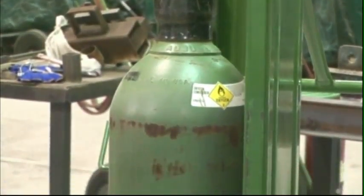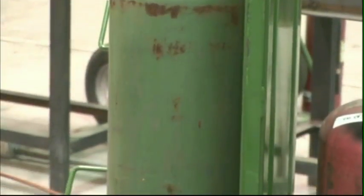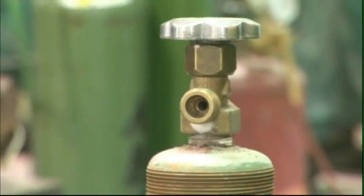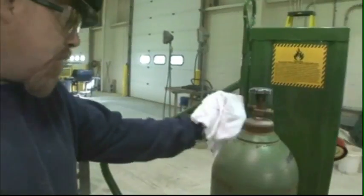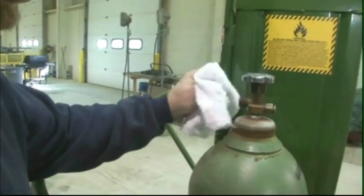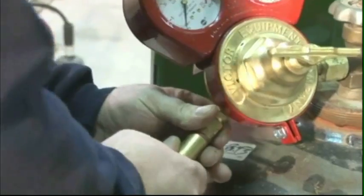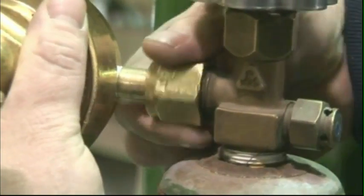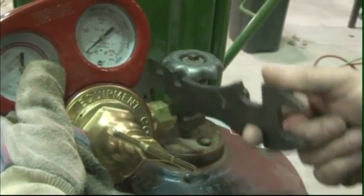Before you fire up your cutting torch, you need to conduct a thorough inspection of the oxyacetylene equipment. Inspect the cylinder valve and regulator threads for traces of oil or grease, and for any damage. Connect the acetylene regulator, flashback valve, and hose fittings. Brass fittings should be hand tightened first, and then wrench tightened.